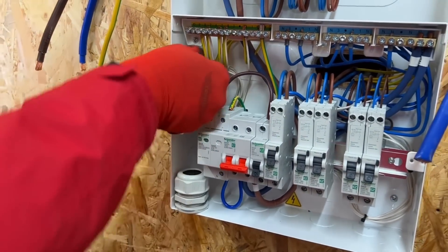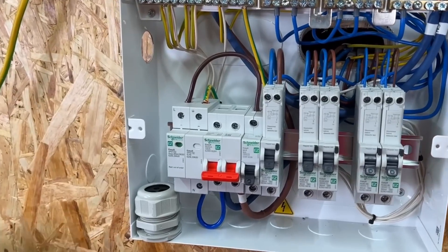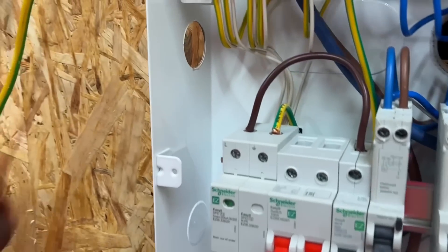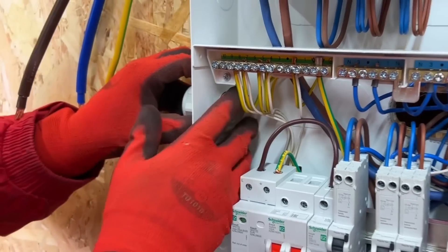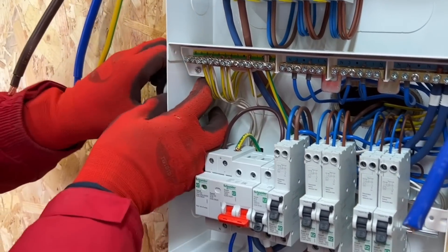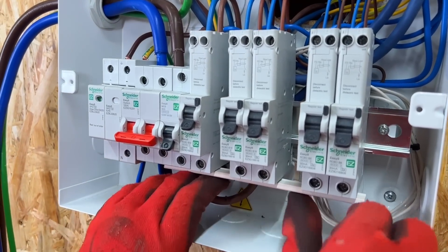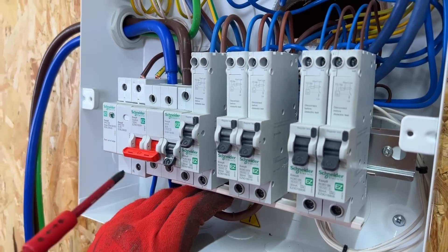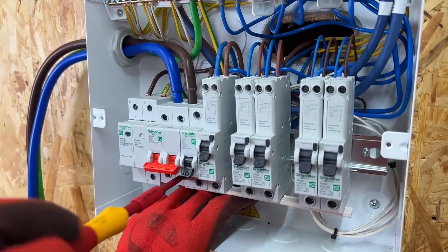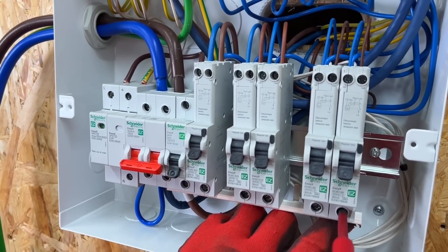So we have plenty of holes to choose from — we're putting our glands and our bus bar in next before we do the lid. Let's just take that off there and put that one into position. That many holes, that many positions you could have come in to. So you've got your tails in, now it's the bus bar to go in, and then we're just going to concentrate on that lid. You said you torque up at the very end, so you're still just nipping these in. Yeah, just getting things into place, and then we'll go around and torque them up afterwards.